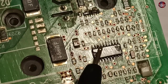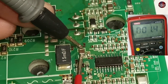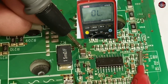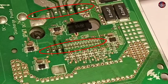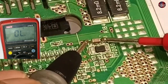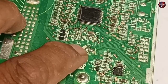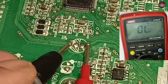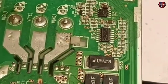The 15 volts flow towards a capacitor and then towards the fourth pin of the IC. Checking this capacitor — it shows continuity. Checking it from the other side as well — the problem could be present here. These 15 volts are also flowing toward the main compressor IPM, where a diode is also installed alongside the capacitor. The multimeter beeps through these capacitors as well. This 15V trace is causing the problem in the PCB; other than that, no issues were found with the rest of the voltages.